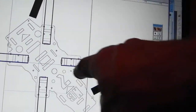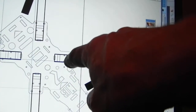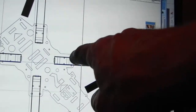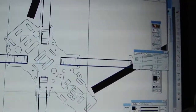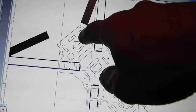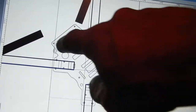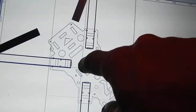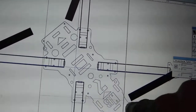Now in this area here, I'm going to recommend sanding, or I'm going to pre-sand or sandblast the CF tube lightly for friction grip, but that'll only be dependent on what the compression is like with the clamps that I've made in 1/4 inch. So we have at the front two more spacers, another 6mm antenna mount with two screws at the front to level out everything, as well as in the middle, at the close back and at the extreme back.